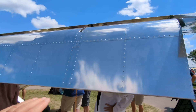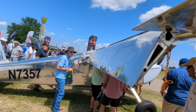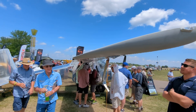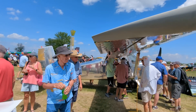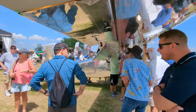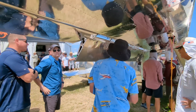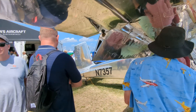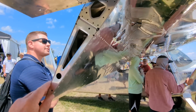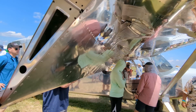He's using an airfoil that's not part of any other RV family. This should be about a 140-knot cruise airplane. They're advertising it right now to be able to get in and out of 400-foot strips, though they haven't given specific data on stall speed or landing distance yet. These are 10-foot Fowler flaps with a 50-degree maximum flap angle.